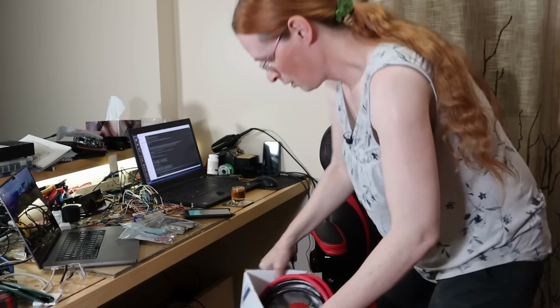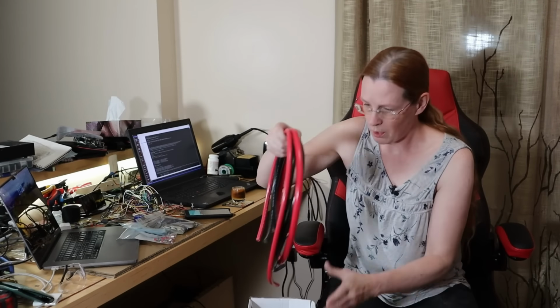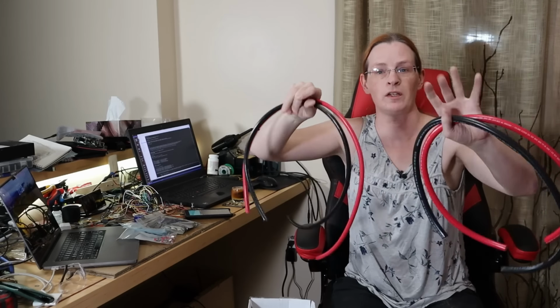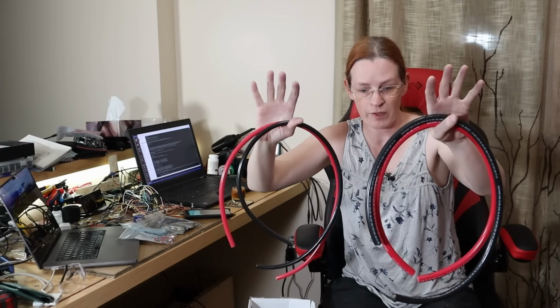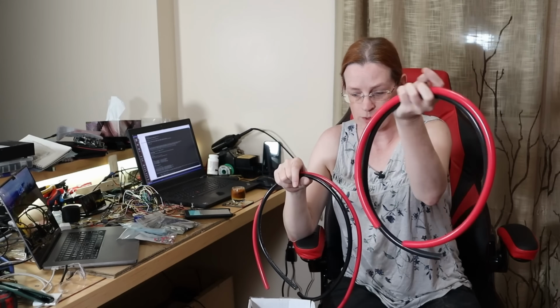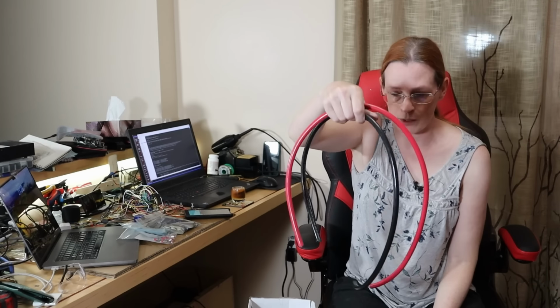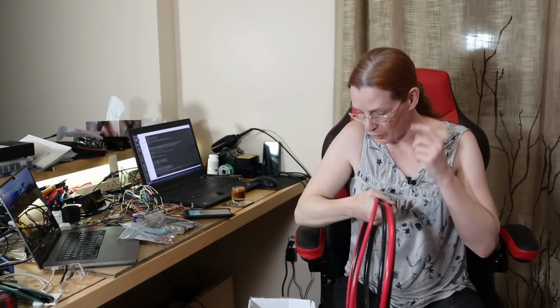Also, on my last trip to the States, I stopped at a chandlery and I found wire by the foot, much cheaper than I could find here in Canada. So I got 3 feet of 2-aught. This brings me to ABYC standards for powering the 10 kilowatt motor. And this is two gauge, which is what I need for powering the 5 kilowatt motor.